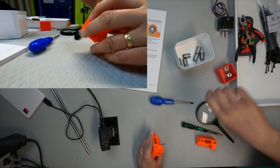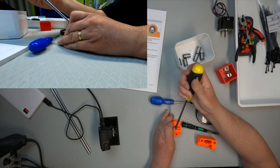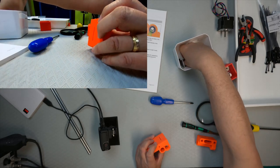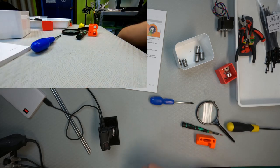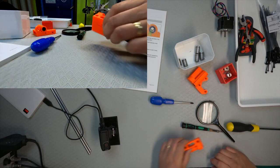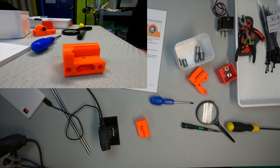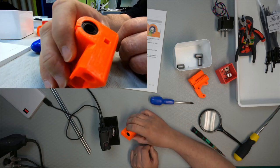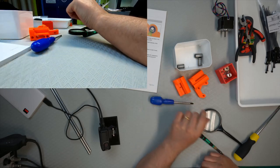Now I'll put the other one in. I think I could take the screw out and open up the cap. Now it's probably okay to just put another bearing in here and use the table to push it down — I can't use this surface, it's soft. So that's that one in. And the next one — I'm going to use the same trick. The same edge here, so I'm just going to leave it embedded. I think it's actually good to have an edge to prevent those bearings from moving.